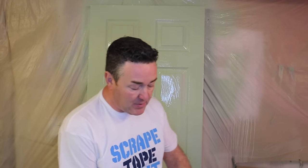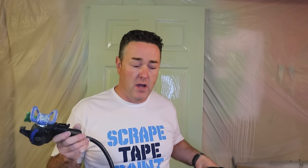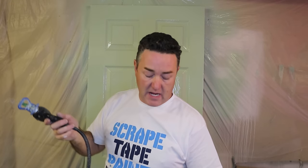If you were doing ceilings with this, your 514, you might get a 5. I've got a 516 Tri-Tech that I use for ceilings. I thin my paint down. And on my big sprayer, I would be spraying around about 1200 to 1500 PSI with a 516 and spraying something like AR2, Tikkurila's Anti-Reflex 2, depending on your temperature of your paint and the temperature of the room as well, but around about 1500.